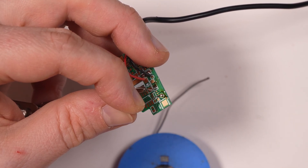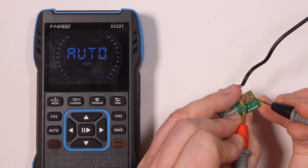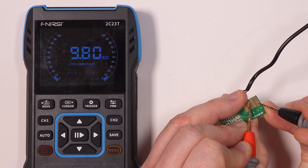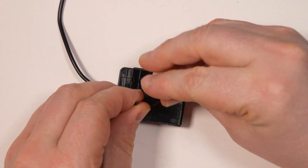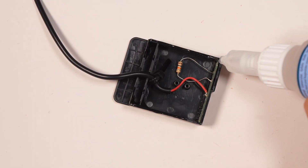When you're done — important — again use the multimeter to check whether you now have 10K resistance between the ground and the T-pad. If you don't, recheck your wiring. Then secure the cable and apply some glue here. And we're done.